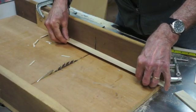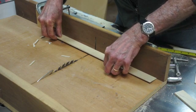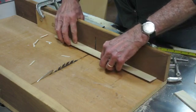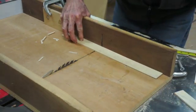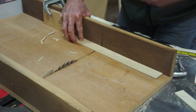To make the parts for the dividers requires the use of a sled and stop block to make the cut. We'll lift the piece tightly up against the stop block. I'll make the cut and then each cut that I make will be exactly the same length.